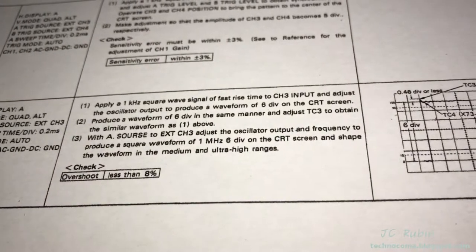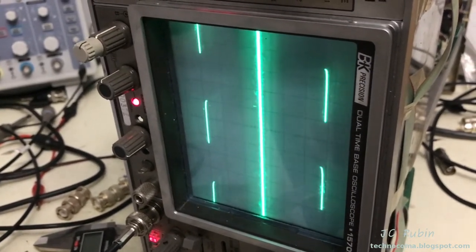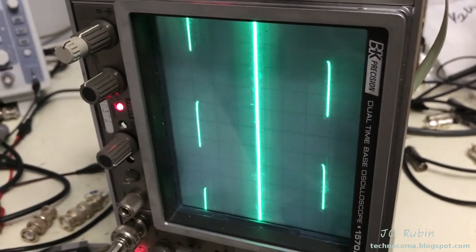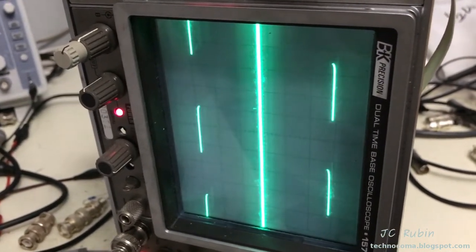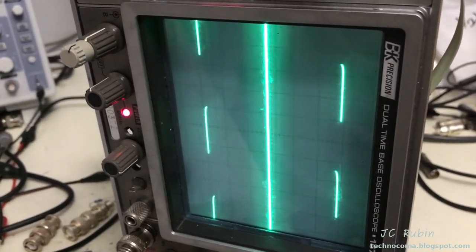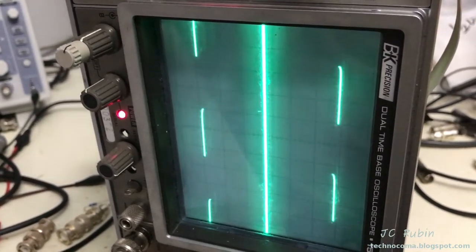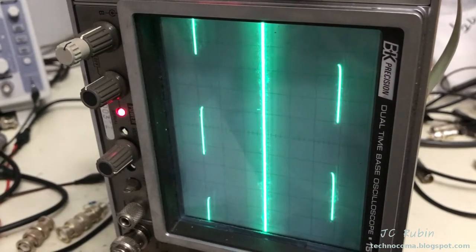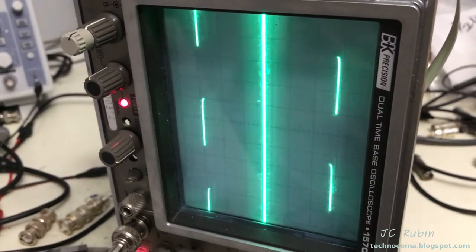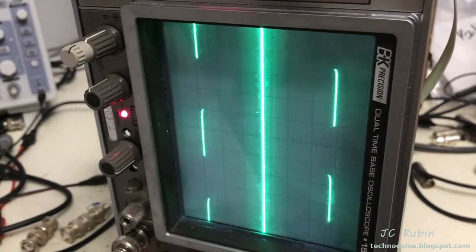I should clarify — it's 1 kilohertz, not 1 megahertz, that we start with. The lines in the middle are just the other three channels. We're looking at the shape of the square wave on the outskirts, and that looks just fine — a little tiny bit of curve at the end, but I really don't care about that. Given that most of the connections on this board are suspect, it's really not worth making an adjustment or hunting it down for something that looks like that. Moving on to the next portion.